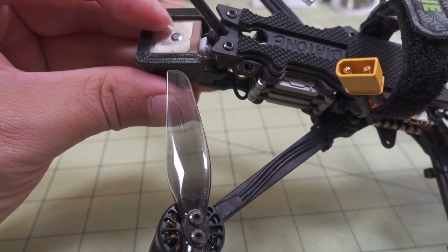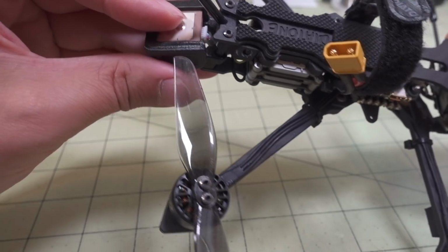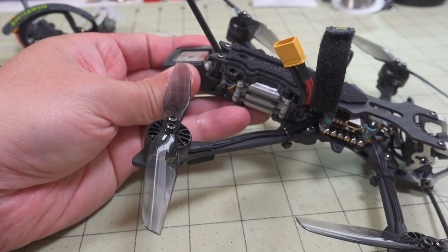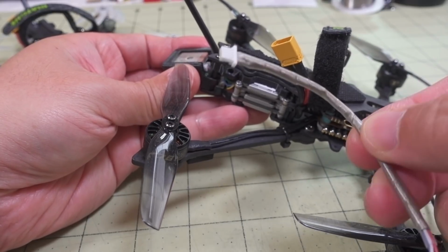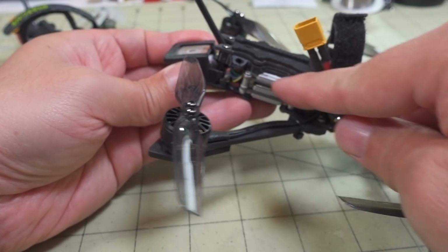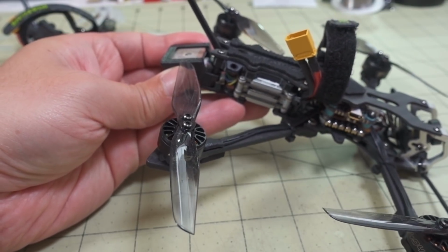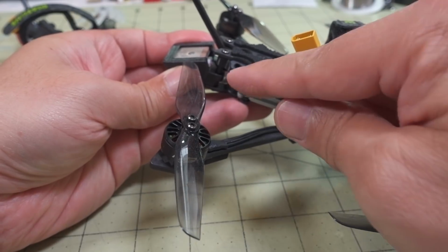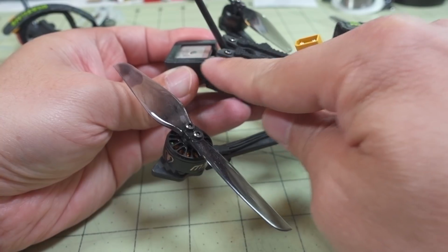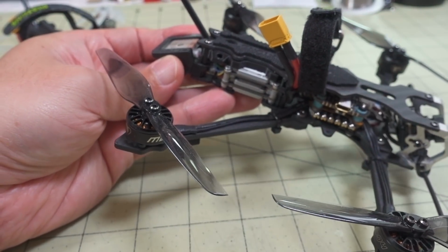This is the BN180 that I guess everyone thinks that because it's smaller, you can't get good signals. And it has to do with the fact that the unshielded cables that were being used before were running over the top of the Vista. And the Vista is creating a lot of RF noise that basically disrupts the signal that's received with the GPS and then transmitted over to the flight controller. And that's why you're having problems.